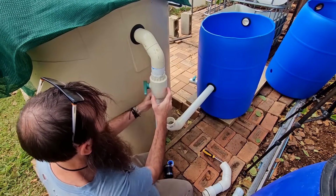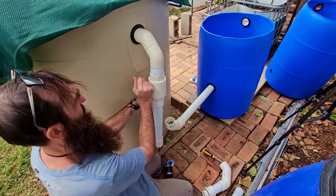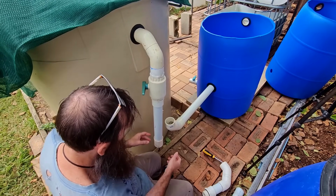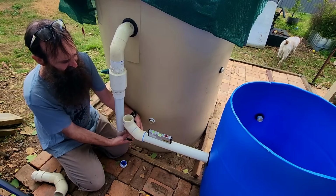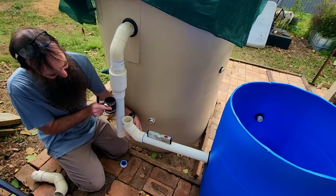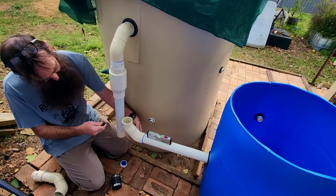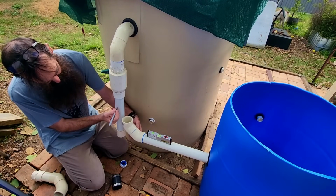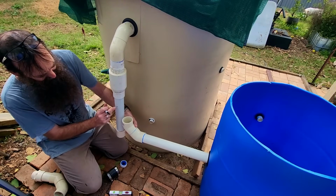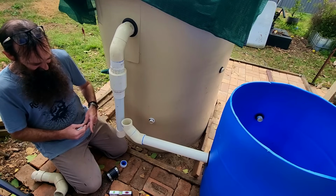So we're not going to get the valve handle all the way around to the front, but I'm fine with that. And just open it off to the side. It'll mean it won't be in the walkway, so that's probably a good thing. So just try and balance that on there. That looks roughly level there, so I have more than enough room to put this cuff on here. I might as well mark this pipe here for cutting, and we might take it off there. So then all I need to do, once we've cut that off, is glue a little bit of pipe in there, and we should be right to go.